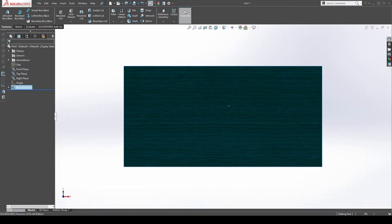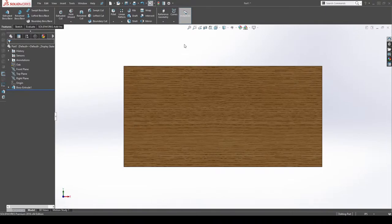So first on the list, shelves. I just moved into this place, and I've got two small closets, like hallway closets. They're smaller than your standard closet. So what we're doing here is currently the boards are OSB, or oriented strand board. Yes, does OSB have its uses? Yes. As a shelf? Not so much. It feels like cheap junk. Looks kind of bad, and they've been used. It just doesn't have the strength that I want it to. So, the goal was to replace it with some 3/4-inch plywood.